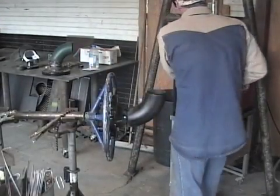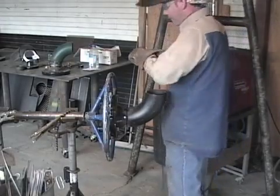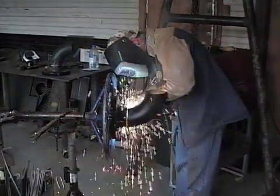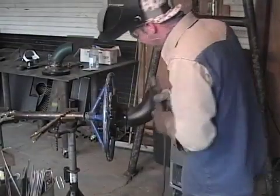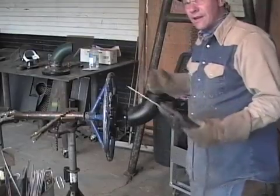It's a little tight. I need to blow my heat up — I'm going to turn my heat up to about 105. Make sure I get penetration on that. One thing you'll want to learn is to weld with both hands, left hand and right hand.